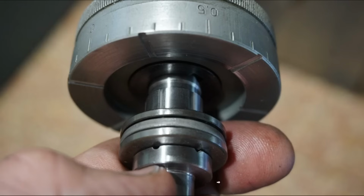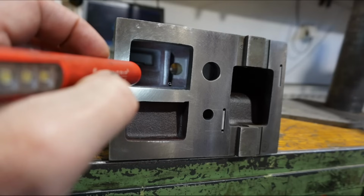So whenever the oil level reaches the height of that cylinder on the shaft, it would drain through these holes, these passages, and these passages to the outside, and thereby also lubricate the center bronze bearing on this cylindrical portion here and the face of this ring here. Here is a view on the inside of the tailstock casting, showing you that rib through which I had to drill a passage so that oil can reach the quill from the outside. So that required a bit of planning that I wouldn't miss this rib here.